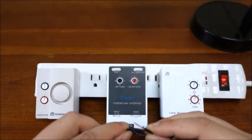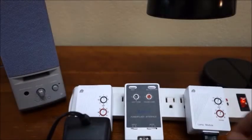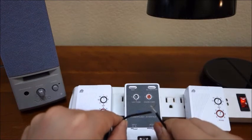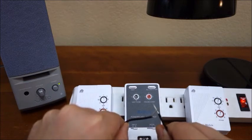Once disengaged, flashing stops, the lights will remain on, and the siren will stop after a few seconds. Mode 3 sends an X10 on when engaged and an X10 off when disengaged to any module set to the same address as the power flash module. Use this mode for simple on-off commands of any X10 module set to the same house and unit code as the PSC01.